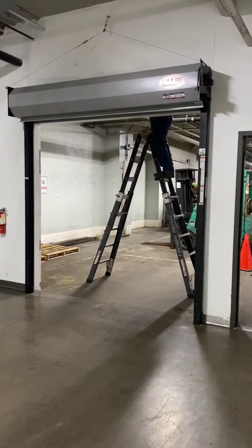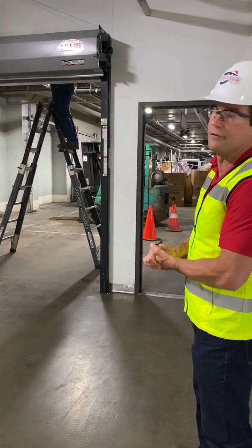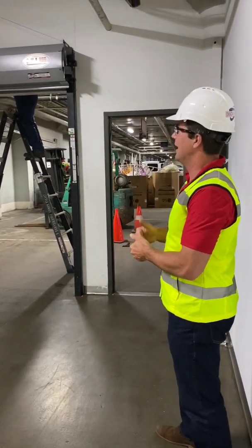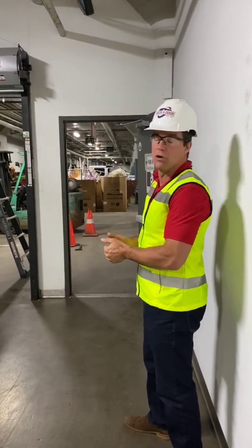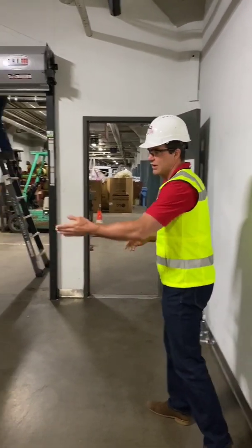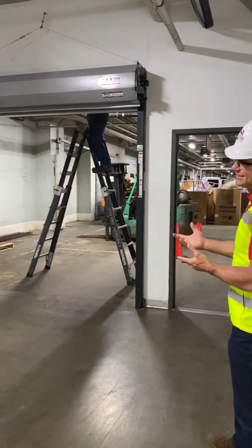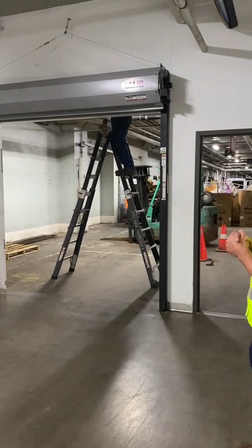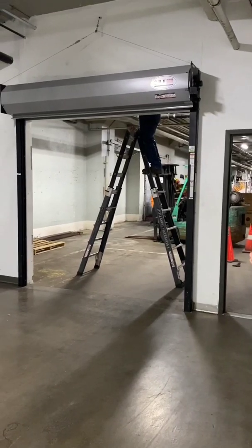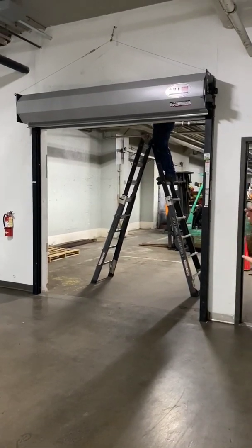When the door comes down, we have to make sure it goes all the way to the floor. If we have a gap at the floor, that's a fail. We want to make sure it comes down and rests on the floor. You're going to notice that it actually accelerates on the way down — a larger door makes that more noticeable — but that is very normal and common due to spring tension. One other thing before we drop the door: we have the area barricaded and a spotter on the other side. Safety first — we don't want any accidents. We always have a witness on this; in this particular case our client was unable to make it today, so we're sending a video as proof. Go ahead and release — watch the arm come down.